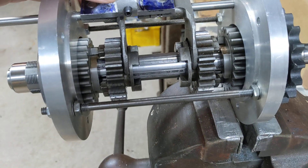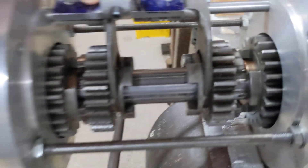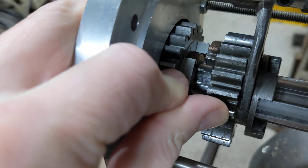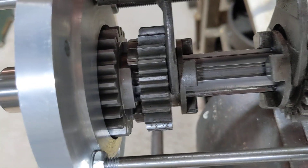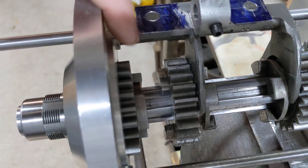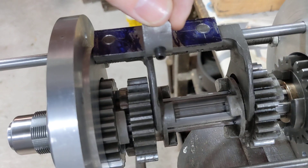As a proof of concept, just to check that things work — and they do work when you get everything lined up. There we go, it does select the gear on that side, and on the other side you can see how the gear does get selected. However, the dog doesn't go fully home on that side, whereas it has on the other side, and that's because this part of the mechanism is touching the plate on the end of the gearbox before the dog goes fully home.